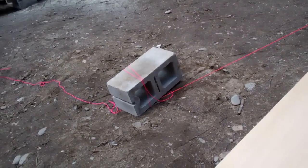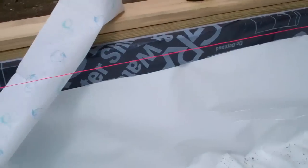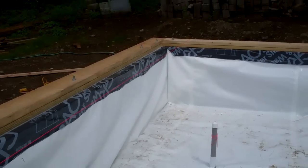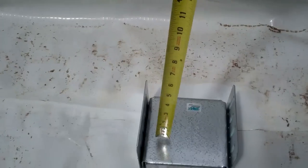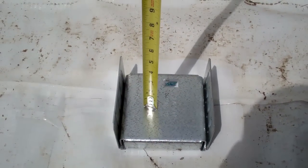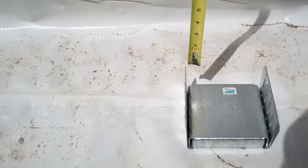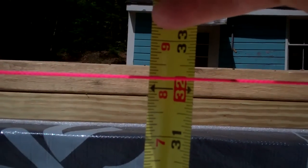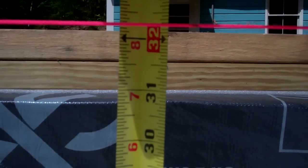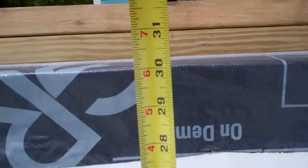Next I need to cut my posts, and I don't know the exact height, so basically I strung this string under that cinder block, goes over the sill, across, and over that sill where it's also anchored. Right here I have the base plate where my post is going to go, and what I'm doing is putting the measuring tape on the plate and then measuring up to the line, so I can see basically how tall that height is to make it equal with the sill plates all the way around.